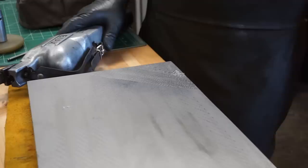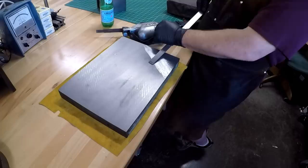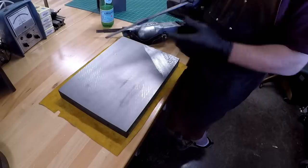I know I'm going to sound like a broken record, but one tool: get a 60 radius, and make sure it's flexible because you need to be able to feel what you're doing. Your depth of cut is definitely determined by the amount of pressure you put on your tool. Your width of cut will be determined partially by pressure, but a lot with respect to the radius of the tool. But this is a good middle-of-the-ground way to start.